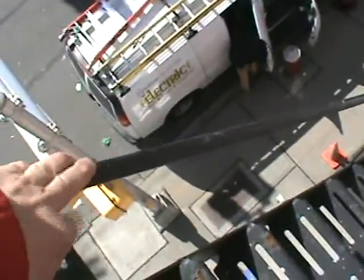Everything has to be rebolted, especially on major points, like these bars right across that are holding the whole grating. They need to be replaced. And as we go down, you can see a big gap between the railing and the stringer. Those need to be closed with one or two extra bars. That way any small child won't fall from the fire escape in case of emergency.